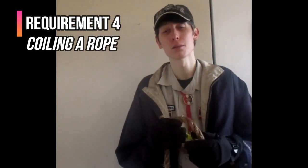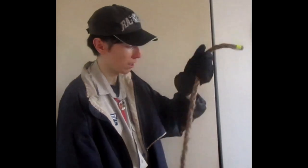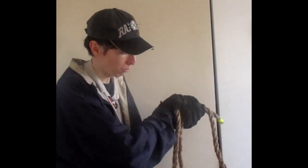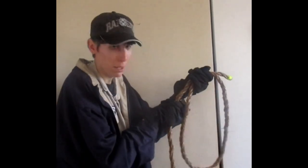Here's how you properly coil a rope — I'll show you a couple of methods. We need to know this so we can properly store rope for future use without it getting bent, because rope — especially synthetic rope — has a memory. If you crumple it up and throw it in a locker, it's probably going to develop a memory and become almost useless. When I first learned how to coil a rope, the person who taught me said you take your hand and go down the rope, bring it up and coil around, and as you make a loop, you give it a little twist to prevent kinking.